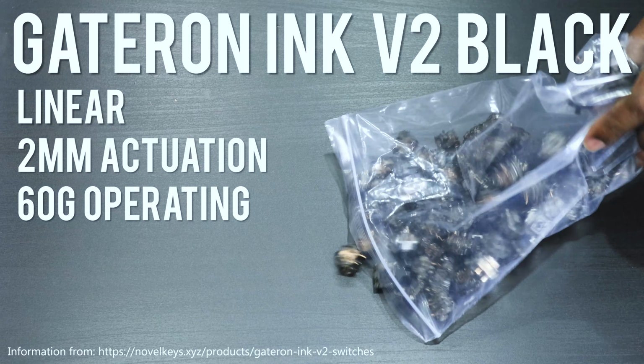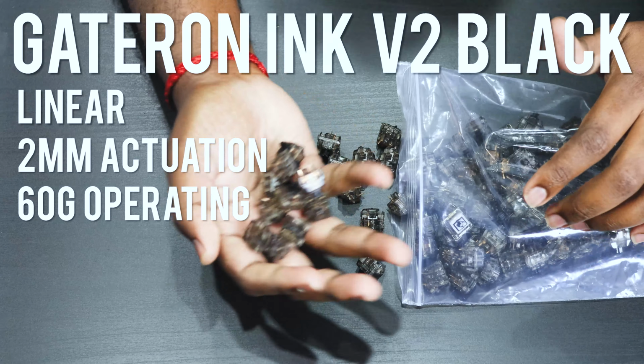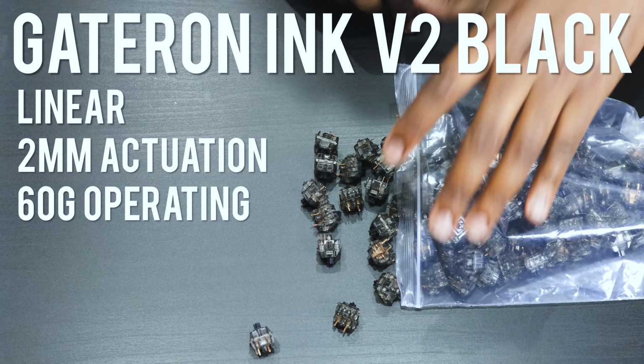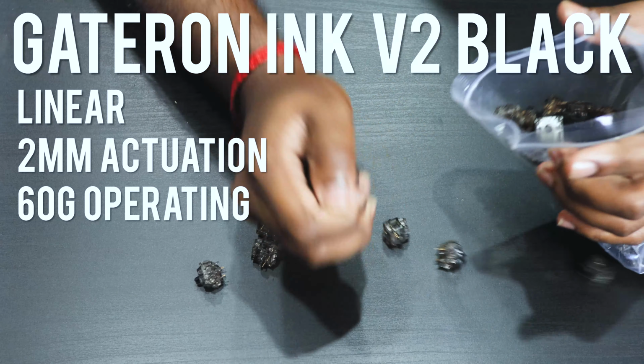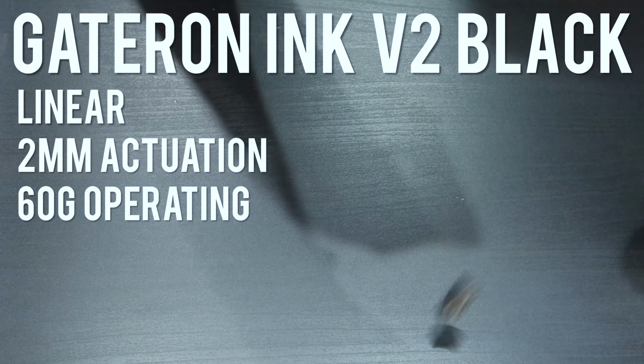The Gateron Ink V2 Black. Beautiful sounding linears with 60 grams of actuation force, 78 grams of bottom out, 2mm actuation travel, and 4mm bottom out travel. And of course, I did lube them.